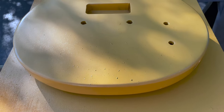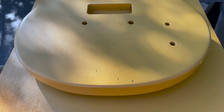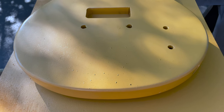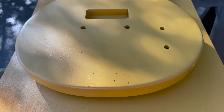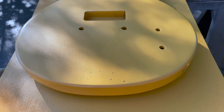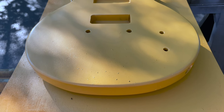The tip about heating up your lacquer cans before you spray — it's a real thing. I thought I could get away without doing it on the second can because it's pretty hot outside already, but room temperature wasn't enough and sure enough it splattered all over. So I'm going to take 800 grit and just lightly wipe those down before I do any more coats.